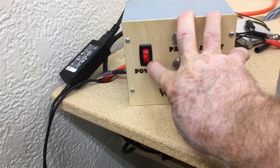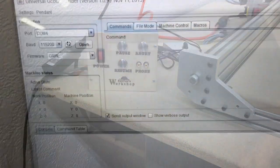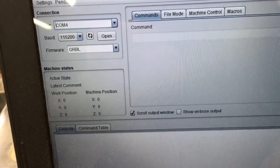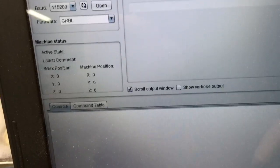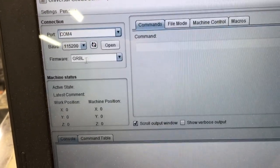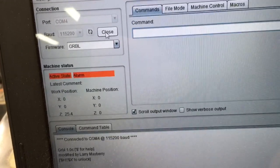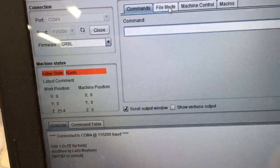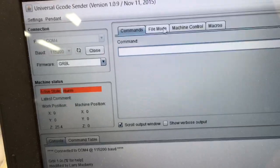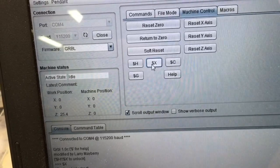It's now time to turn on the new carve CNC machine. As I open the Universal G-Code Sender, of course the first thing you have to do is verify that you have the COM port, the baud rate, and the GRBL setting. Now that should be there — you really shouldn't have to change anything. So I can just go ahead and hit Open. The first thing that I get is the alarm code, and that's because of the homing sequence with the limit switches, and I'm not using that. So all I need to do is just click on the dollar sign X, and that will clear the alarm.